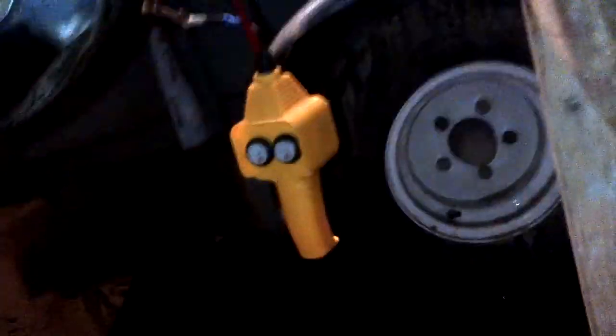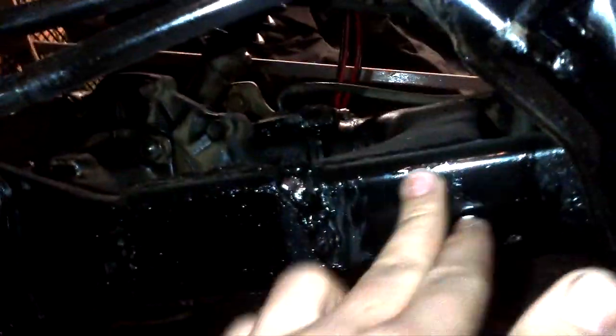But the biggest problem with these, even on the Foremans, everything, even the ATCs and all that, the biggest problem was these swing arms. They would rust out. See, there's a hole there, a hole back there. This one's still okay, but it's broken before. The front broke too, and on both sides there it broke. But they're pretty much indestructible as long as you take care of them. Change the oil, do the gear case oil, check your bearings.